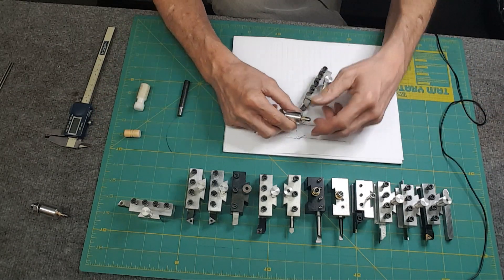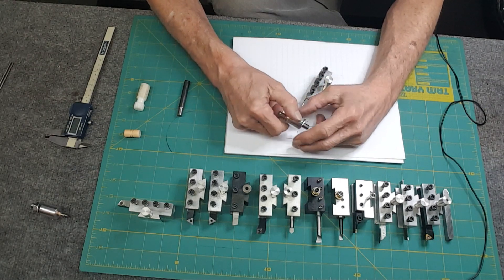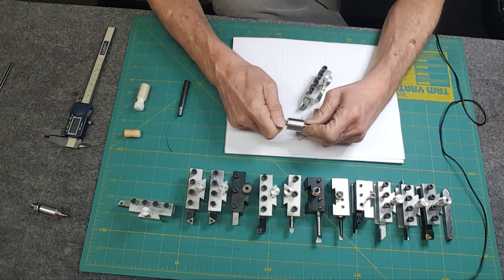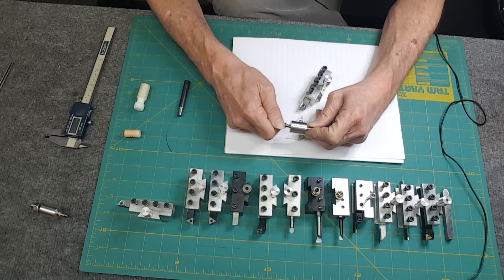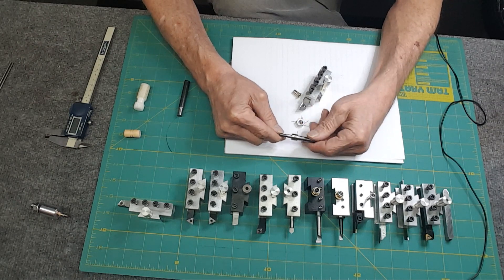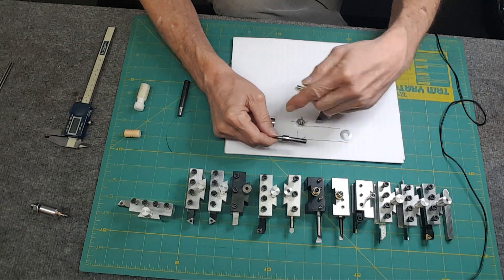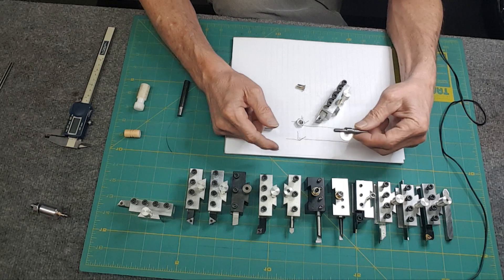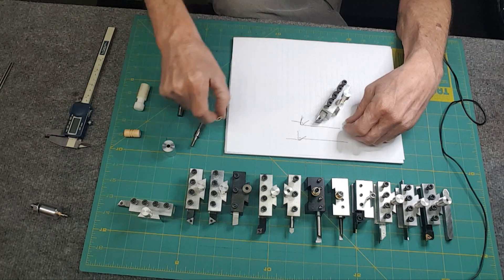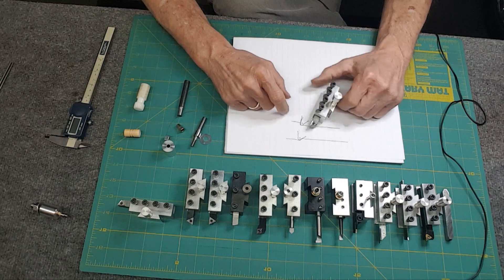This piece is 1144 steel, which is pretty hard. I've discovered that the harder the material, the nicer the finish you get. There's the finish on 1144 going in at an angle — in and over. That's aluminum and the rivet-nut setting tool I'm still working on.